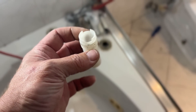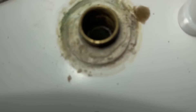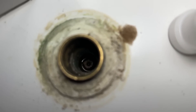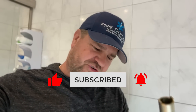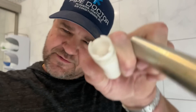I got one out, but the other one — she ain't looking too good. She definitely ain't looking too good. She don't want to come out. So I called my Moen rep — I know it's Sunday morning at 10:30, he was probably in church or doing something. He told me to take this outside and grind it down. Now we're going to shove it into this little piece of plastic and hopefully that'll be able to spin it out.